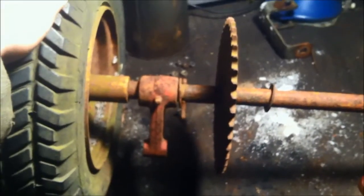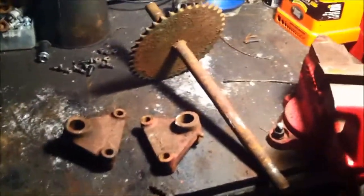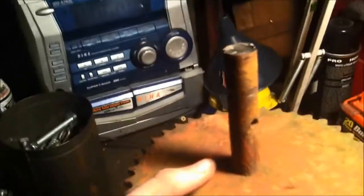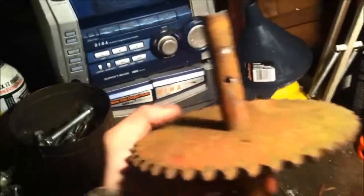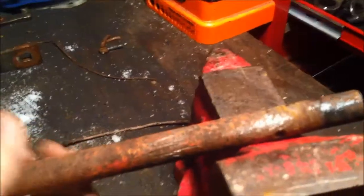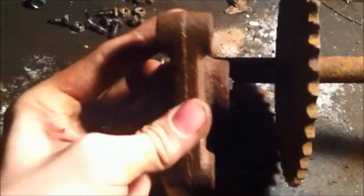Voila. There's all the hardware for the jackshaft spool drum. These are in pretty good condition — really heavy duty and should do me pretty good. This sprocket is in pretty good condition too. All of these short shafts aren't obviously cut to length yet. You can see where the cotter pins went. I need to probably buy four washers. When this goes on, you can just unbolt this and slip it off — same with the other side. Just put a washer, unbolt the pillow block, and that slips off. So you can remove this whole thing if you have to. Just two more washers right there in the rear for the spool.